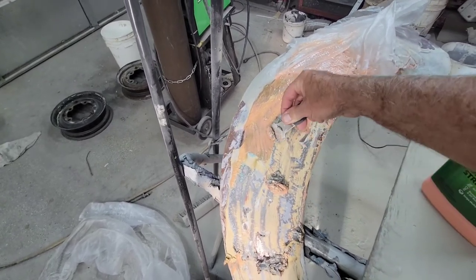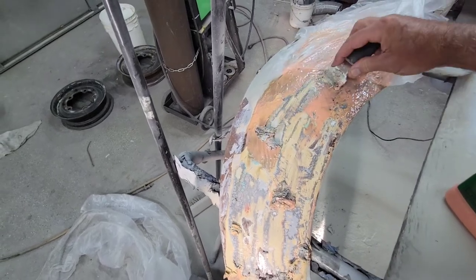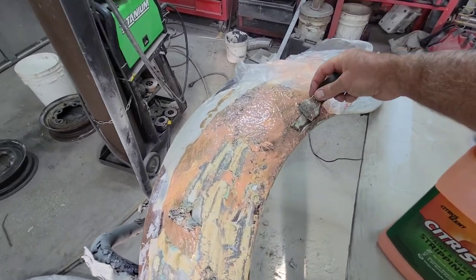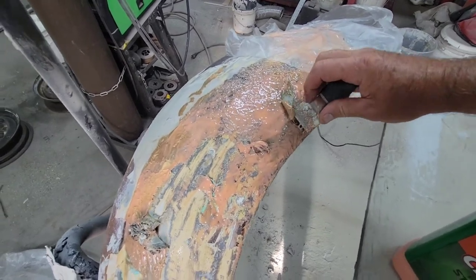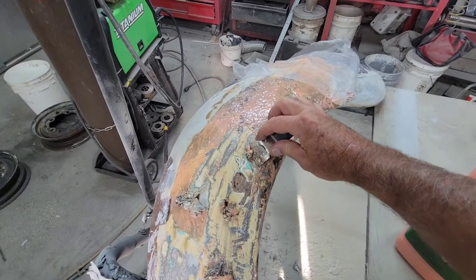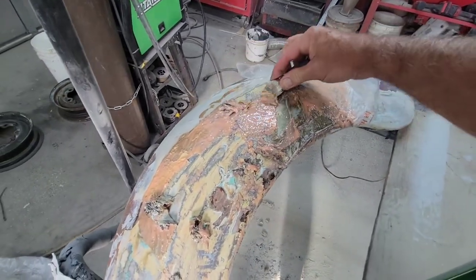So for these softer paints, this stuff kind of works if you leave it on for a while. The trick with this product is to definitely cover it in plastic — I think if you didn't, it probably wouldn't do anything. It's just softened the paint; it's not like it's peeling off. So you still need a razor blade or something. If I took a really stiff wire brush on a grinder, it'll probably take it down to metal pretty quickly from here. It's kind of cool — if you're looking for something non-toxic, it does work.